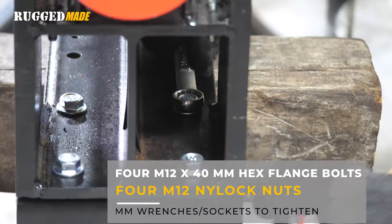Now we have our main cylinder connected to the A and B ports on our downstream valve and we can move on to the fittings for the log lift cylinder. The remaining two three quarter inch MPT by half inch JIC fittings go in the A and B work ports of the upstream valve for the log lift. These don't have the interference issue so it doesn't matter which one you install first. We'll start with one pointing straight back and test fit one of the long half inch high pressure hoses that's going to connect to the log lift cylinder, looking for routing that doesn't have any kinks, tight turns, or stress on the hoses. Now set up the other one to be parallel.